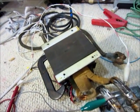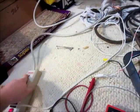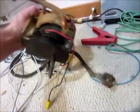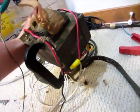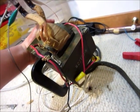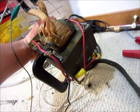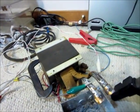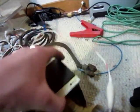When dead shorted out, it does at least 15 amps because it blows the circuit breaker. I should measure that input current when it's shorted out, but it seems to have two primaries. The way it was actually hooked up when I found it, it didn't work — it had spade terminals on it, and two of the wires were connected together, and it didn't work that way no matter how I hooked it up. So I cut the spade terminal off, and it works fine now when I rewired it a different way.